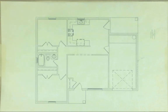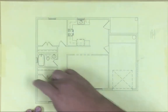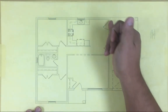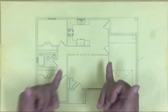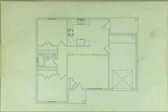The typical one here in the valley, we're gonna have footings first of all along the entire perimeter of the house, and then we're gonna use some of these walls where they cut in to continue our footing there. You want to do that to save material and make it easier at the job site. We'll also see if this plan is too big from footing to footing, and if so we might have to add another one in the middle.